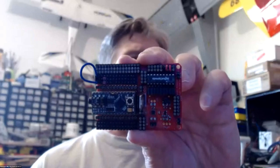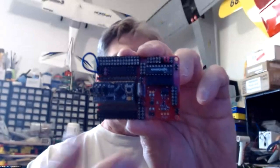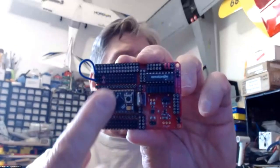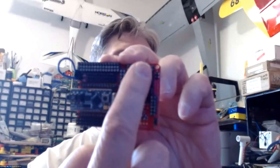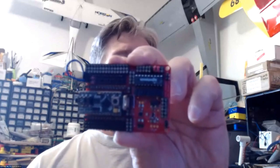Anyway, after looking all over online and not being able to find a small enough microcontroller board to fit inside the Billy Bot, I decided, okay, I can design one. And I started designing the RoboGuts board. The RoboGuts board is pretty basic. You've got your breadboard section here. Then this is a little audio amplifier over here. Above that is a SpeakJet chip. The SpeakJet chip allows you to program phonemes into the chip, send phoneme data to the chip so it can talk and sing in pretty much any language, even Klingon.